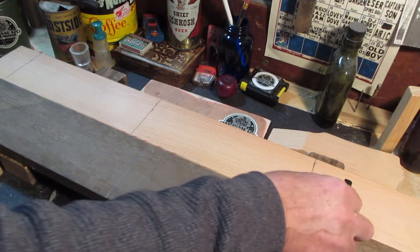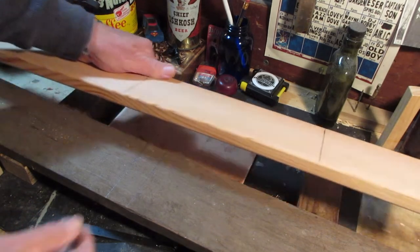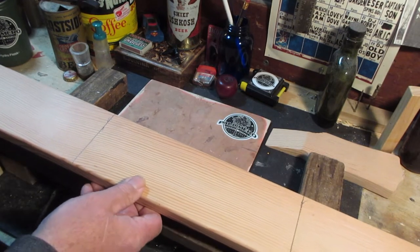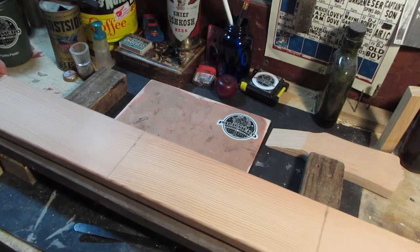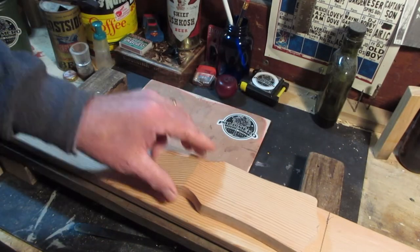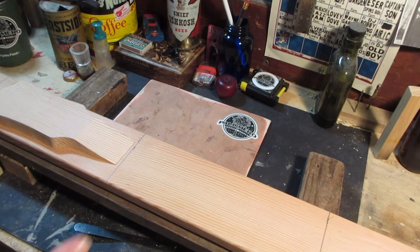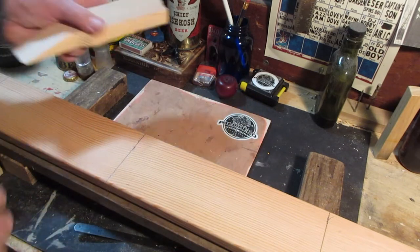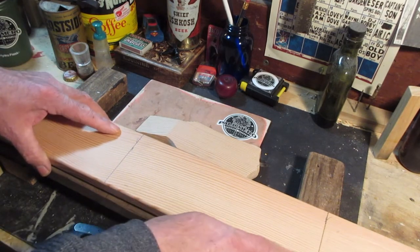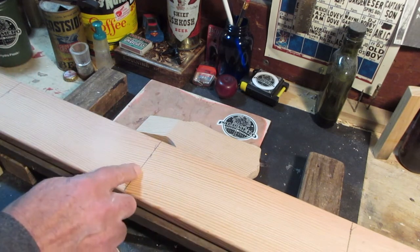I have a piece of new wood. I'm going to put this over here on that box. That box is pretty fancy. Got a piece of new wood that I bought from the Topanga Canyon Hardware Store. That's got some significance. And so what I've done here is I've marked this off. I hope you can see. Remember when we cut our headstocks, we're going to be doing about 10 inches or so. And so I've measured out plenty of wood here for two headstocks on this new piece of board that's not as thick as the 3/4 inch, but certainly over the 1/2 inch. And I've marked this off, measured out where I've got two 10 inch pieces.